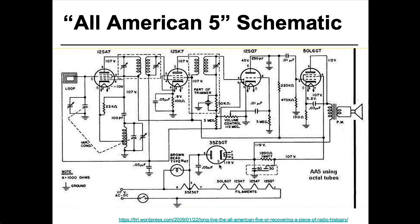Notice there's only one diode tube here — so this is a half wave rectifier, and half of the power is basically getting thrown away. They put the switch on the chassis side. So even if you plug this in properly and have the hot at the top and the neutral at the bottom, the chassis is still hooked to the hot even when it's switched off. All you have is the resistance of the filaments to protect you, and that's not enough. This can still kill you even when it's switched off.